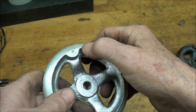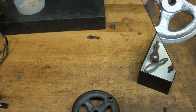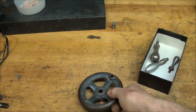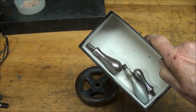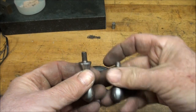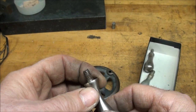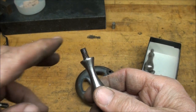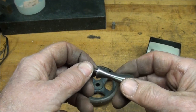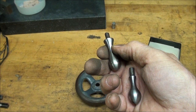So I had to dress it off just a little bit and center-punch it as if I had never gone to that trouble. I'll now pilot drill this. The original crank handle is just press-fit in there, and I need one for the new hand wheel. I did have several of those crank handles in my junk drawer, but none that would press-fit on. This one is approximately the same size — a little bit larger — but it has a one-fourth twenty thread on the end. So my change of plans is to drill and tap my new aluminum hand wheel to fit this, and I'm going to Loctite that in place.